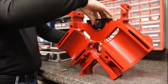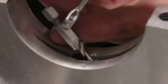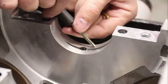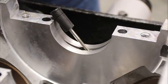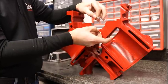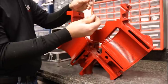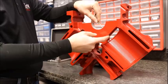We leave the drill bit in, take the main jig back out, take a centering tap, and tap the hole that we just put in. Then we take an actual tap and run it down far enough to make sure the jet goes through but does not go all the way through to the end. We want the threads to go through basically to where the jet will just protrude through the cylinder wall. The jet itself is broached — we take an allen head, slide it down, and screw it into the hole so it protrudes out of the cylinder wall.